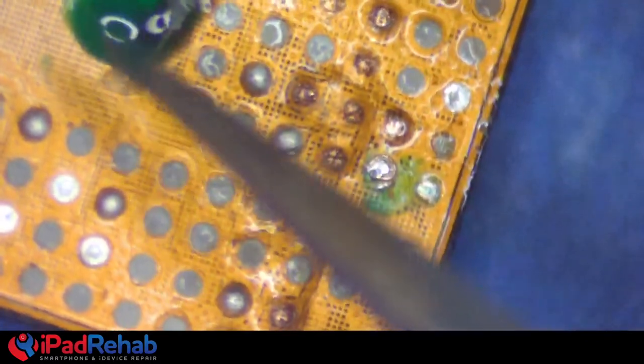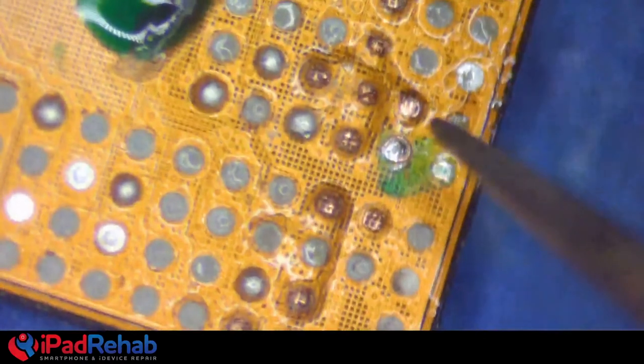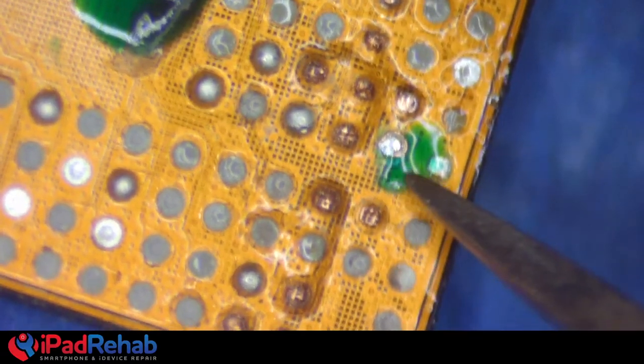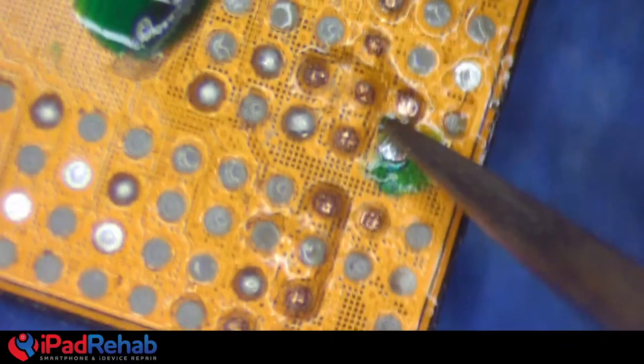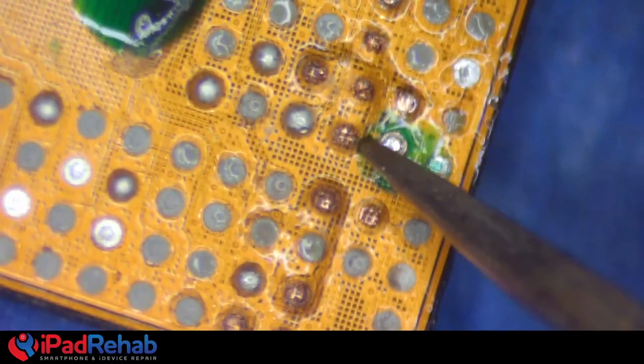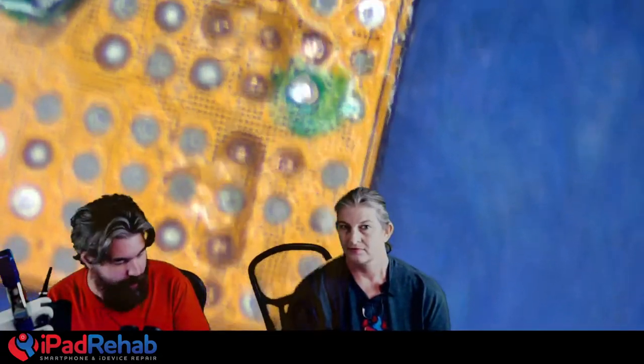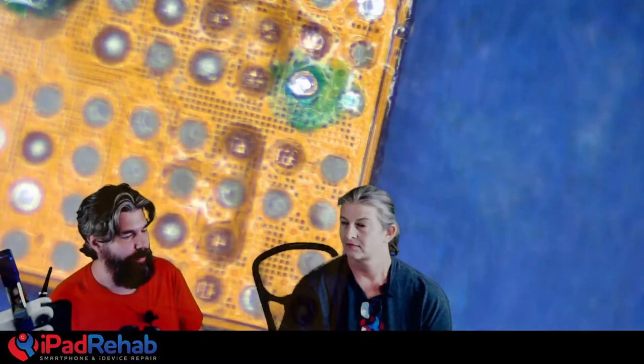Yeah, the last step would be to put a little bit more of this green just around the edges, just to kind of strengthen it a little bit. This is very thinned out UV mask. Would that just wipe away if you ran an iron across it? It would hold up to maybe one or two passes with an iron with no pressure. That is really thin. So then we cure that, and then this will be strong enough to stick into a stencil, reball the CPU, and...